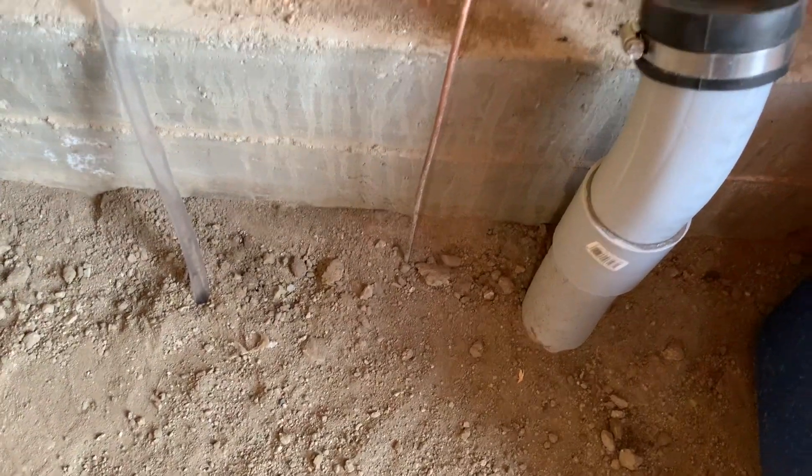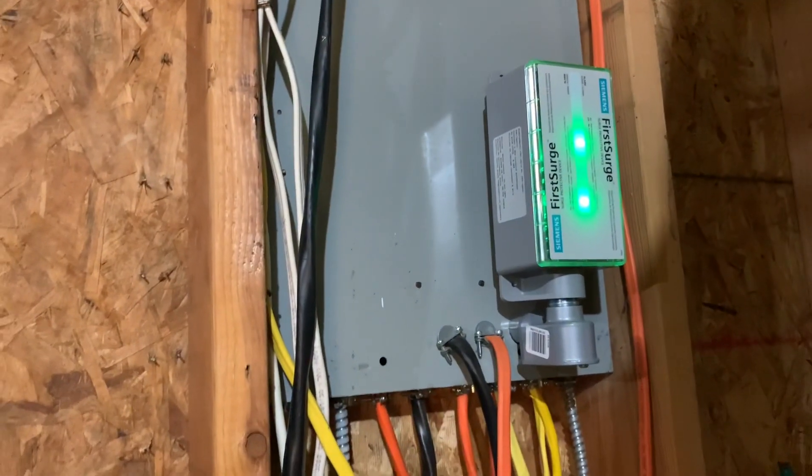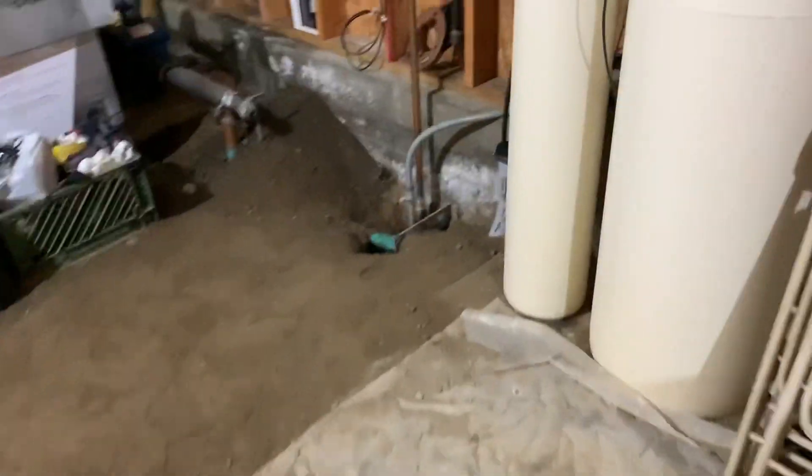They're all bonded together. So there's this ground rod here in the cellar, then I have another one right about here, and it's bonded, then it continues over here. This ground rod here is kind of a central point. From here, that's my service panel entry ground, and that's a whole-house 240-volt surge suppressor. The service panel is bonded to this central point. Then the house Ufer is bonded. Then I extend it over to my cable entry panel which is back here. That's number 4 solid that comes up, feeds through here, and I'll take you outside to show you the cable entry panel.